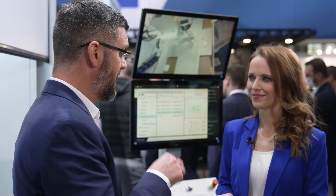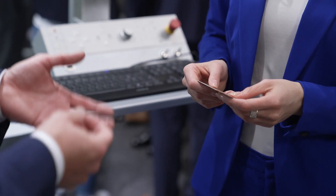This means that we don't have long-term melt that can form intermetallic alloys. These intermetallic alloys, which happen with conventional welding, can form brittle intermetallic compounds that can have very different properties to the two materials being joined together. This means the weld can be weak and can also have things like lower electrical conductivity. With this process we have a very limited melt time, meaning the two metals do not actually metallurgically interact — it's more of a mechanical bond than a metallurgical one.